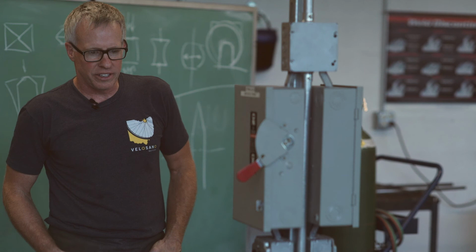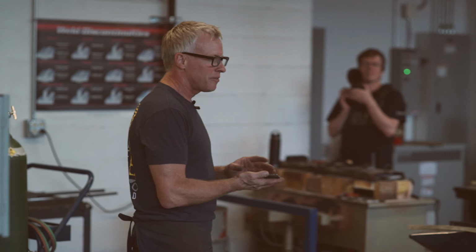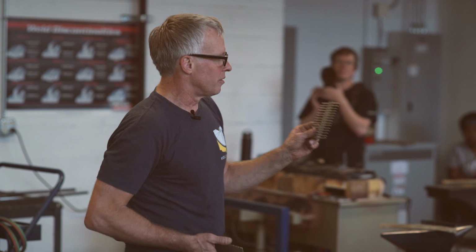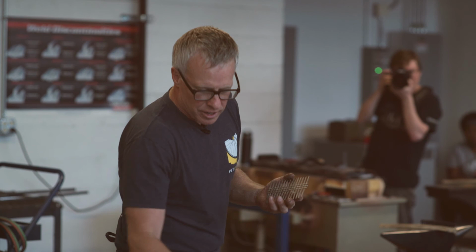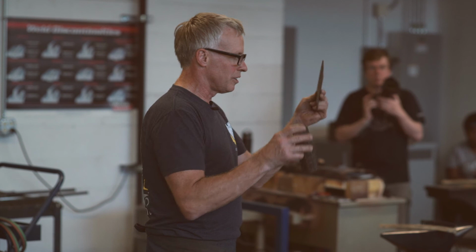This one? So, like I said earlier, steel under heat and pressure will stick to itself. And so if you took a similar piece to this, this is just woven wire. So it's, you know, 3/4 inch centers, whatever. But the closest thing I brought was this. So this smashed into here and taken away imparts this texture into here. But if you take that and forge weld it down, so fuse it down to it, you get that. And that's what this was, a different texture, of course, but basically making a flat sheet like this. And then I rolled it up into a cylinder, and there's a joint right here.